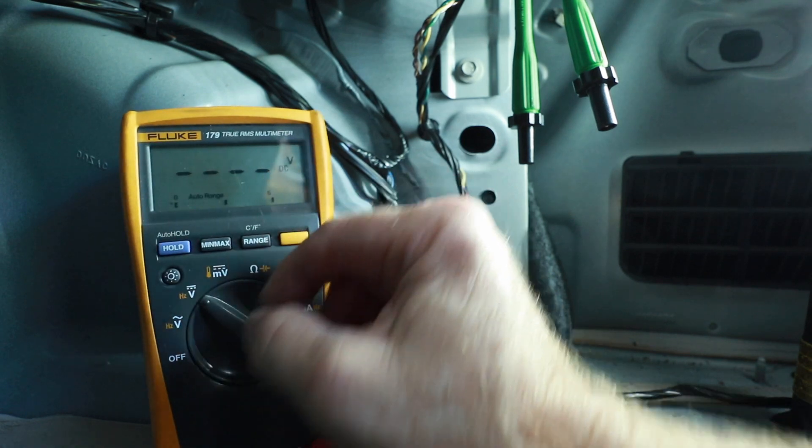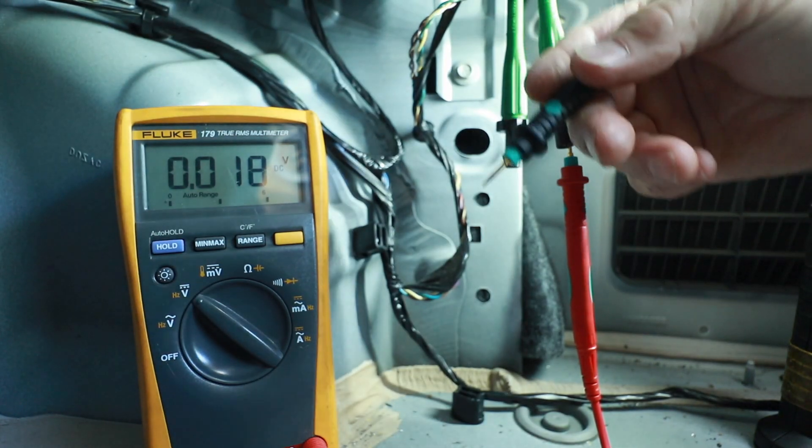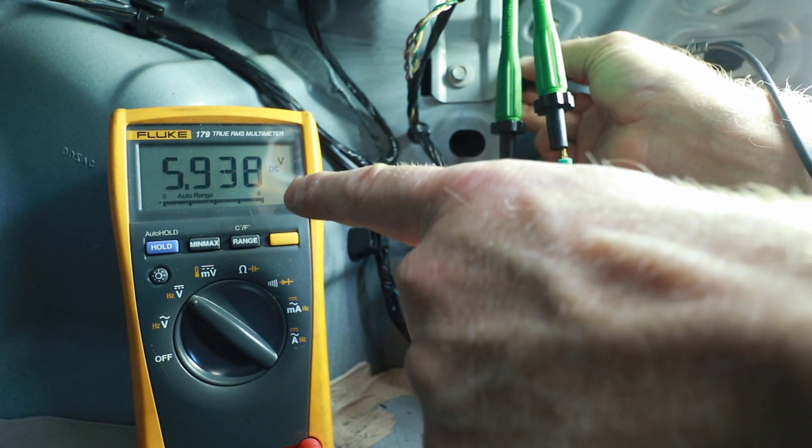What makes this amplifier interesting is that we're going to be using high level, and it uses DC offset in order to turn on the amplifier - and there's no switch to turn it off. So we have to test for DC offset and make sure it turns off and turns on. DC offset is a five to six volt DC signal riding over the AC signal output - there's DC hidden in that signal we just measured. Switch the meter to DC voltage again, which is the line with the dots underneath it. Take the positive test lead, connect it to one of your speaker leads, and take the negative and connect it to a ground. The digital multimeter will read five to six volts of output.